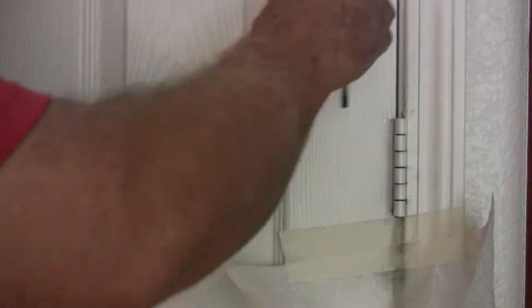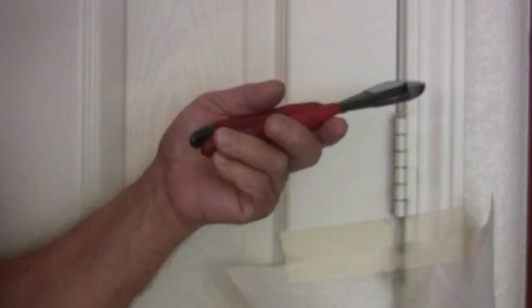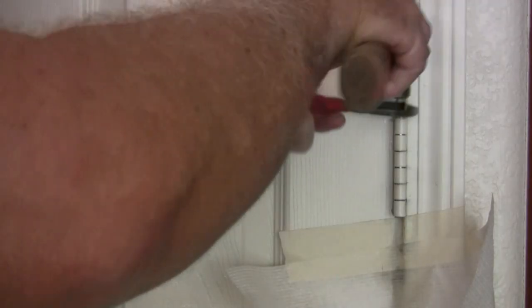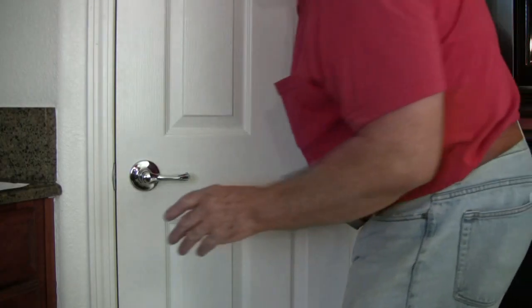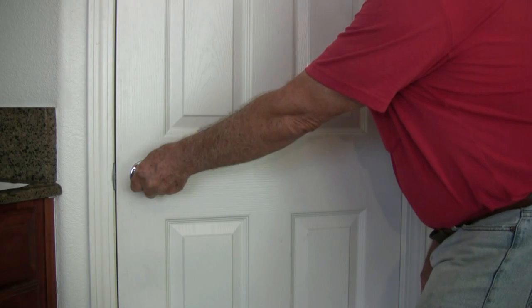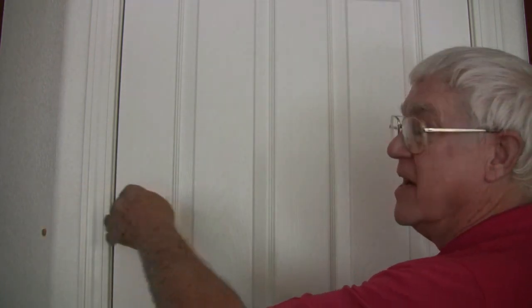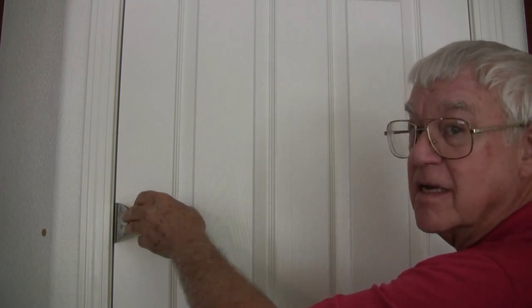Because the hinge is going to dribble even more when we put the pin back in, we leave the pouch in place. For this job, all we need are the dykes and the hammer, and of course the pin. Set the pin in the top of the hinge, turn the dykes the opposite of the way they were before — top side down — and in it goes. But what if you can't get the pin back in because the knuckles are separated? With a two-hinge door this could be a problem. If it's the top hinge, grab the door by the knob and pull up toward the top hinge. That may marry the knuckles, but you may need somebody else to put the pin in. Another method is to take a putty knife, stick it between the door and the jamb, and lever it toward the problem hinge to get the knuckles to come together.